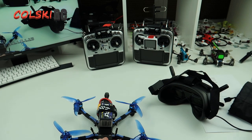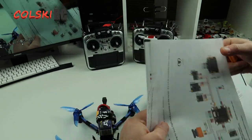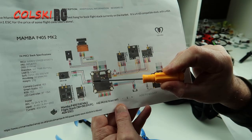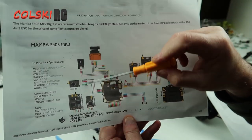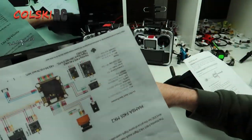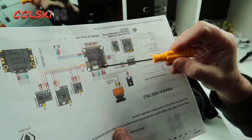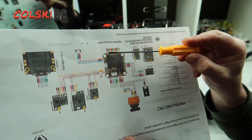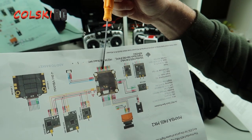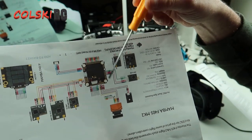So let me go through the wiring quickly. Forget the fact that it's anything special — if you haven't bought the DJI transmitter, you don't need it. All I did was connect ground, signal, and 5V for my receiver — I'm running an XM Plus. For the air unit, connect the red and black wires to VBAT and ground — battery voltage and ground. Then I used UART 6 and connected TX and RX. From the air unit itself you do it the opposite way around — so the RX goes to the TX and the TX goes to the RX.